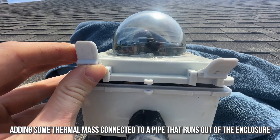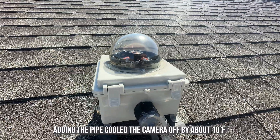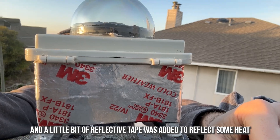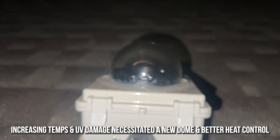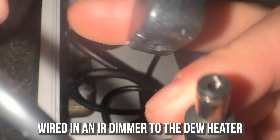I added a little pipe with two holes and two corner pieces that lets ambient air flow into the box — something more thermally conductive than the plastic. The idea is I add some chain and metal in there and the ambient air flows through the pipe to cool the camera. I also added reflective tape to help reflect heat from the roof away from the box. The rising temperature approaching summer meant I needed to change the dome — it was getting sun bleached and something was gassing off inside and coating the interior. Luckily I have a spare IR dimmer with a remote control so I can point it at the dome and control how much heat the dew heater strap produces.